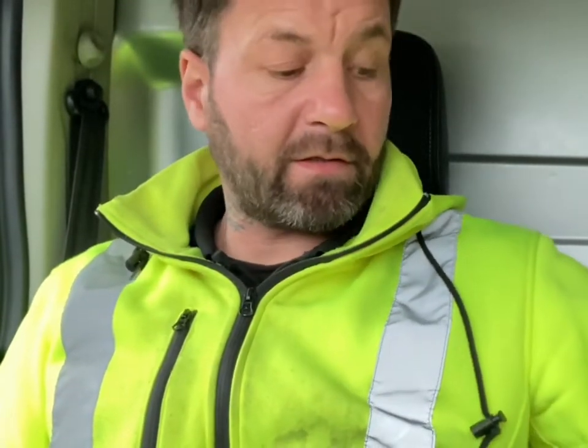unless you've got two cables in there, which I've had arguments on Facebook about. My view is basically, as I said in previous videos, if you've got two cables sitting either side of each other in a termination, it's exactly the same as bending one termination over, because it makes the same surface area for it to sit on. But if you've been shown and you prefer to bend over two cores of a cable, terminate and carry on doing so, if your college or training provider has told you that, carry on doing that. That's me covering my arse.